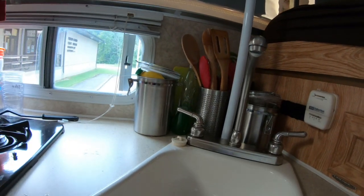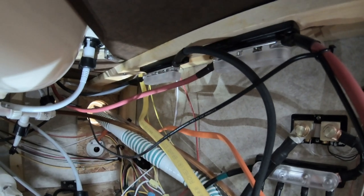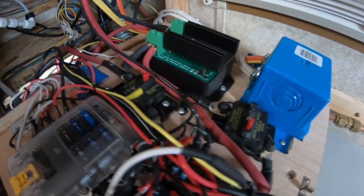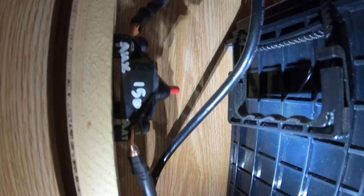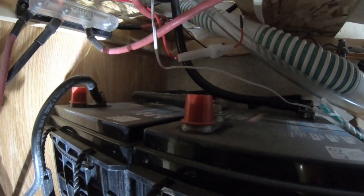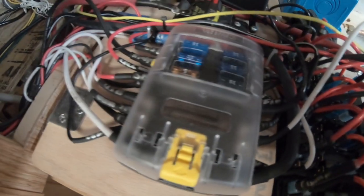Power comes off the roof and through this tube, down through the sink area, merging underneath here. You can see those two bus bars there — the red wire is the positive and that comes down into a breaker, then from the breaker goes into the solar controller. From the solar controller, power moves to that bus bar and then off that bus bar down that black heavy-gauge cable into that 150-amp breaker and over to the battery. Power flows both ways: coming off the batteries it goes back through that breaker to the bus bar, where it can go either to the breaker box via the 50-amp breaker or to the inverter off the 60-amp breaker.